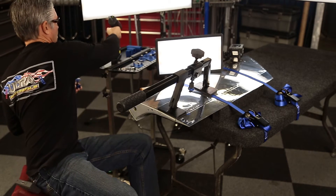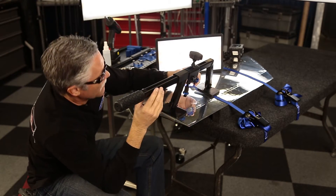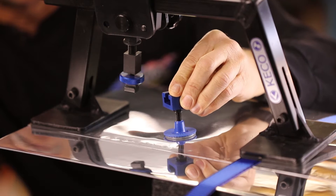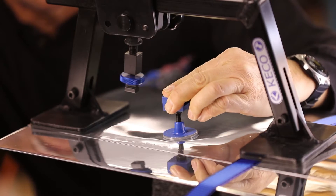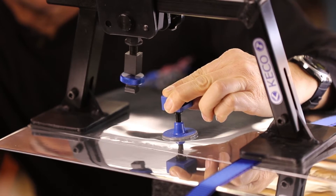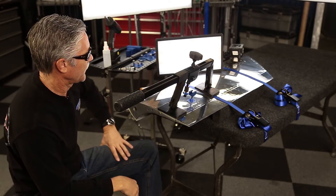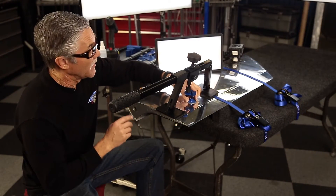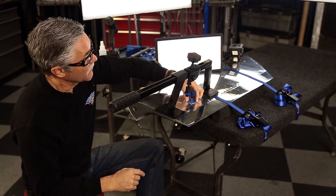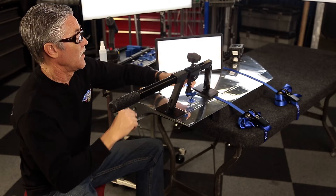Still a little cold. I'm going to put it right in this real big low area right next to that crown. We're going to let that sit for a couple of minutes. We've let our glue cure for about two to three minutes — it depends on the temperature. You want it to be just a little bit tacky still; you don't want to wait too long because it holds better within that time period.